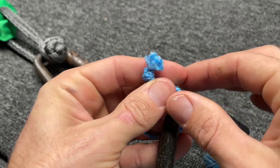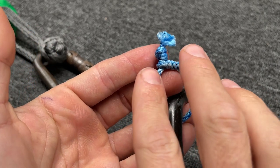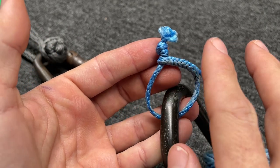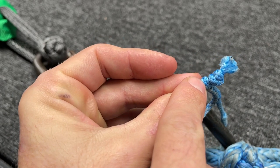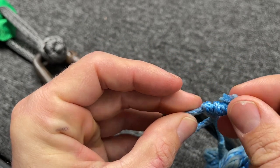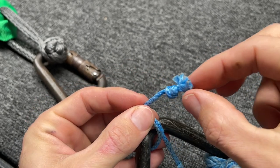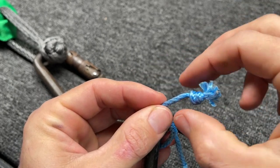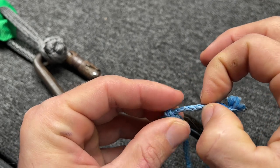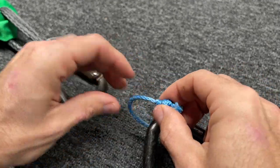We're going to find out how strong it is. A lot of soft shackles are double strand here and double strand here, so you end up getting 4x the strength divided by two because everything's back at the noose. What determines the strength is the bend radius — with two strands and a button knot the top goes back down and gets spliced in, giving you four strand diameters not pinching too tight. This one's pinched pretty tight.